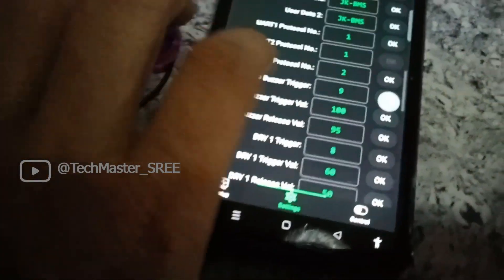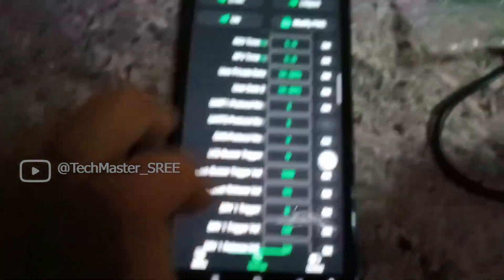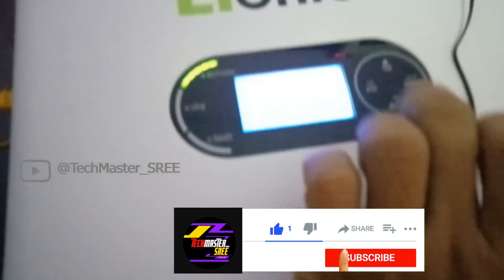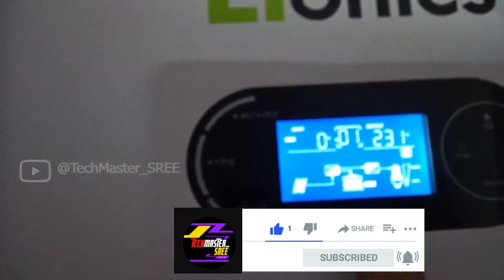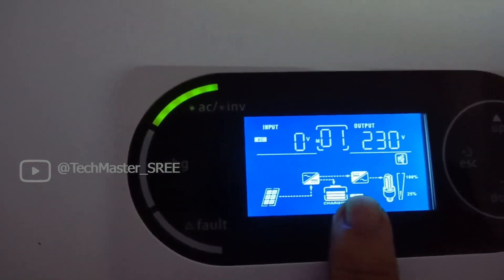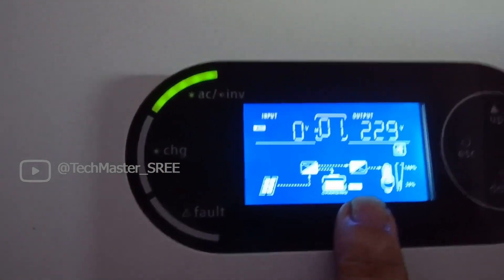For communicating with the inverter we need to take connections from the RS485 or CAN port — here I am taking connections from the CAN port. The first port is RS485; we can use a normal LAN cable if the ports are standard, otherwise we may need to make a DIY cable. Use the JK BMS mobile app to set the communication protocol — here I am setting it to Pylon Tech. You choose the protocol based on your inverter; I am using a Leonix inverter and it supports Pylon Tech protocol, that's why I am choosing it.